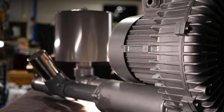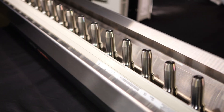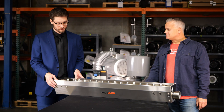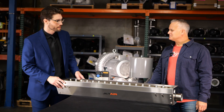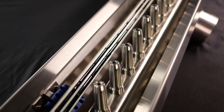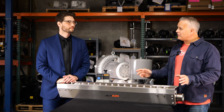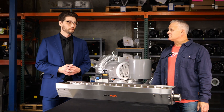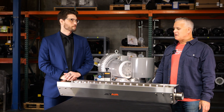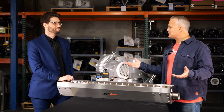Now, when you look at this, this is pretty fancy. Talk about the debris capture box. So, this is our 304 stainless sealed debris capture box, and it looks great just like the rest of the JetAir equipment. What this houses is our ionization bar and our air component. This ionization bar is a little bit different from other ionization bars — it's IP66. So if you need to wash down your line, you're going to be able to hit this with water and not have any concerns. An electrical component you can wash with water — that's unusual, especially in plants.